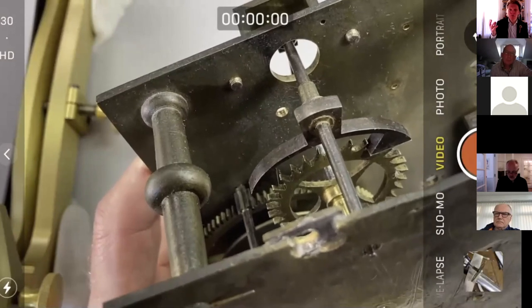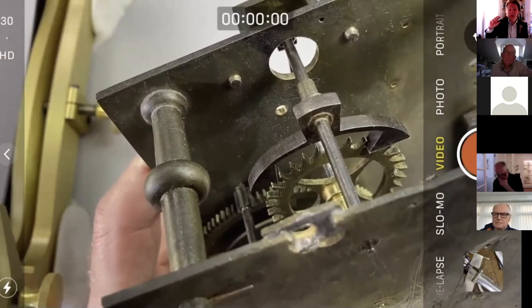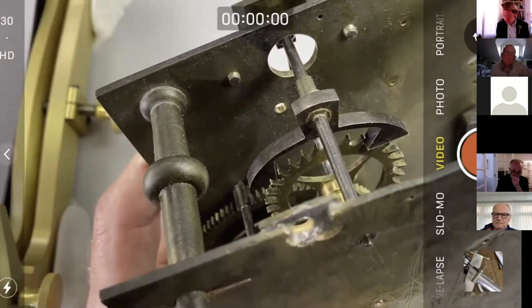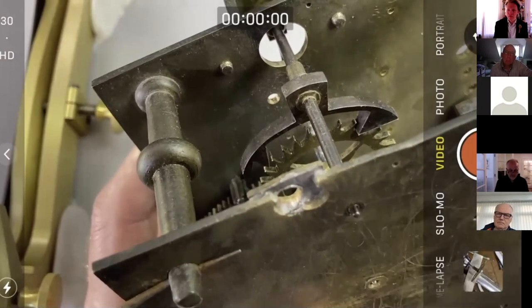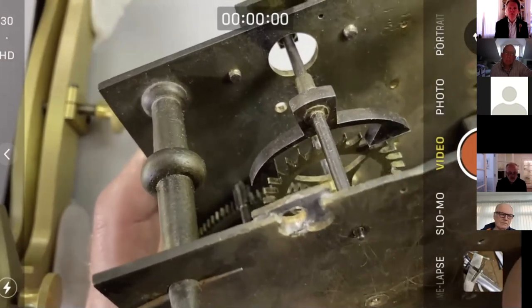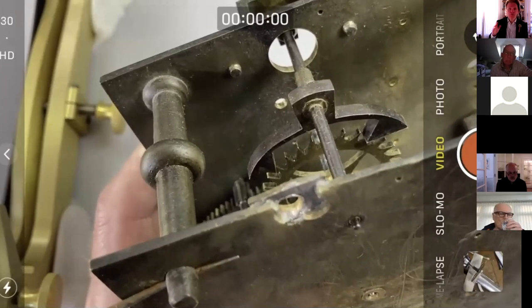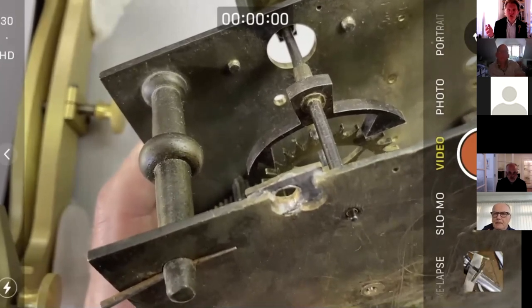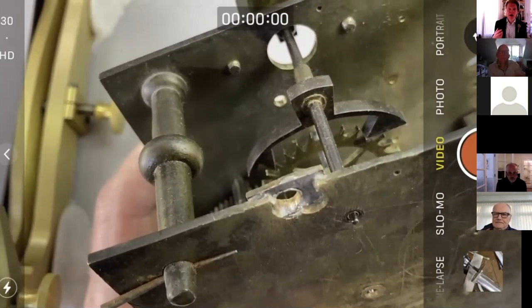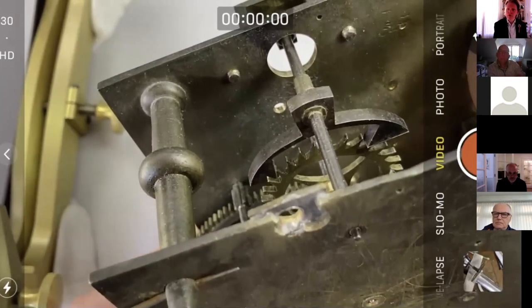Sometimes you can get away with just doing one. And doing that one, we managed to reduce both external and internal drop. We can talk about that again, but if you go back through these videos, we already explain it. So we soldered that on, hardened it, soldered it on, and then with a diamond file, we cut back the exit corner of the entry pallet to develop our internal drop, and everything was hunky-dory.